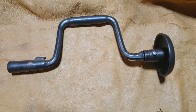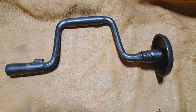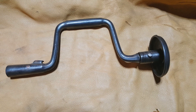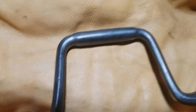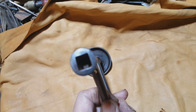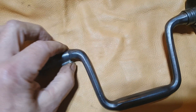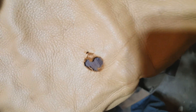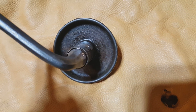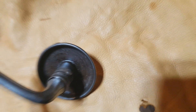Here we have the finished product — this cleaned up pretty well. I did take it for a ride on the wheel, but these guys were finished bright to start with, so unless they're exceptionally rusty they usually clean up pretty good. Inside the chuck also cleaned up well — I took a little sandpaper to it and put some of my special wax mix down inside, just to keep it from future rusting. The inside of the pad had some rusting, which I took off with steel wool and a fine brass brush by hand.